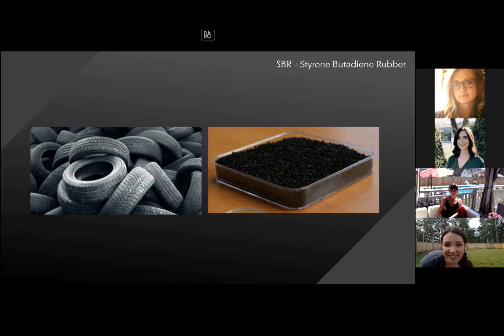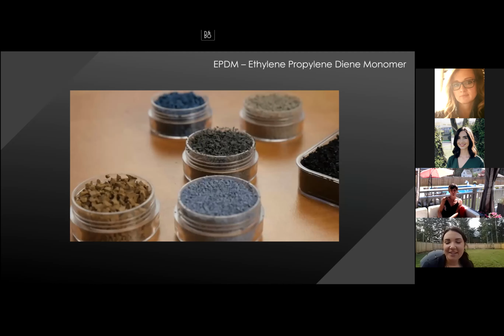One day. So our next ingredient is EPDM, ethylene propylene diene monomer. And that's the colored rubber aspect that we use. And we always use a coarse and a fine in every color that we manufacture. And the reason we do that is because the fines fill in all of the pores, so we get the most dense, less porosity in the marketplace. We get this from Germany.